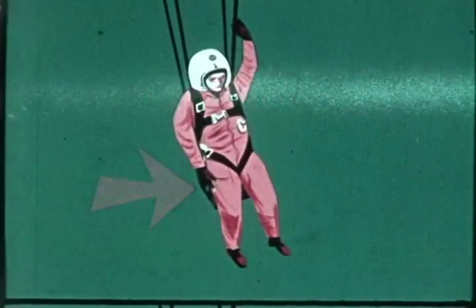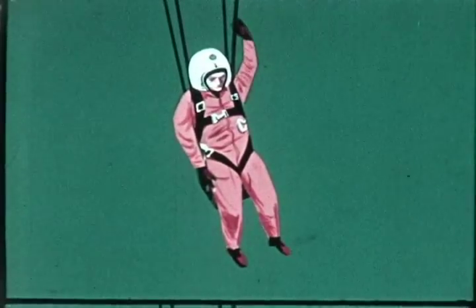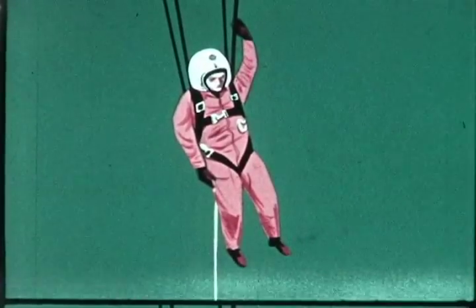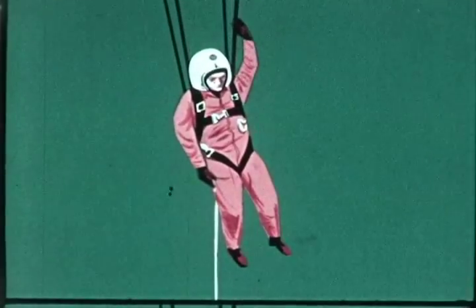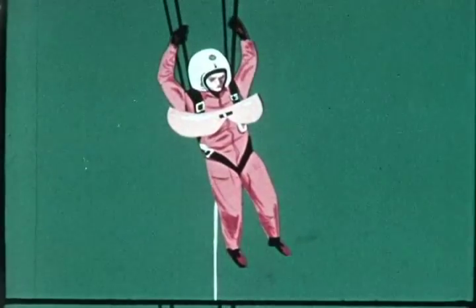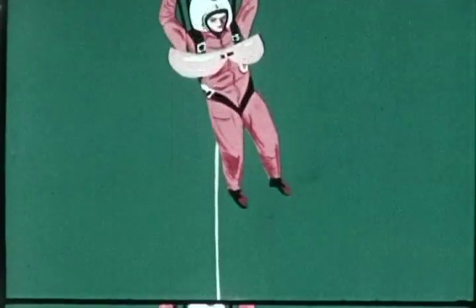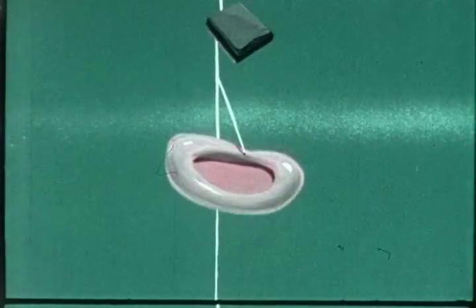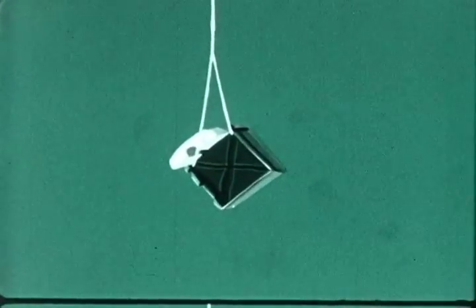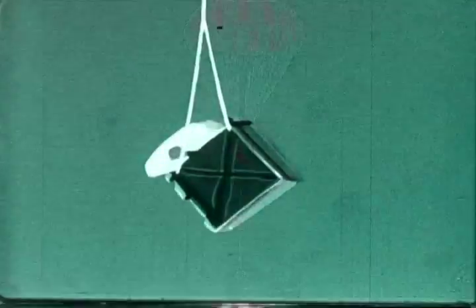This disconnects the kit from the personal leads, as well as from his parachute harness fittings, and causes it to separate and drop away, still attached by a lanyard to the parachute harness. If he is over water, he now inflates his life preservers. The life raft in the kit inflates automatically and falls 15 feet below the pilot. The kit itself drops 25 feet below the pilot, thus landing before him and relieving the parachute of its weight.